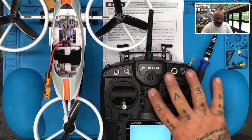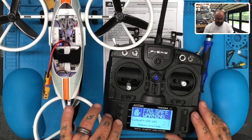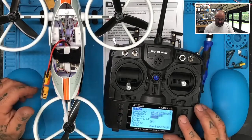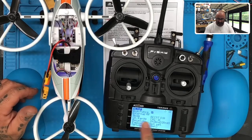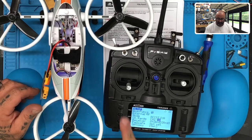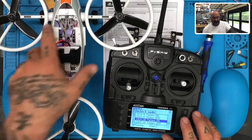I'm going to turn the radio on. Welcome to OpenTX. Throttle warning. I've already got the model set up, so I'm going to hit menu and page to go to my binding option. I'm going to make sure I'm using my internal RF. My mode is ACCST D16, my channels are 1 through 16, and I'm using receiver number 9, since this is model number 9. I'm going to hit bind, and I'm going to use 9 through 16 with telemetry on.